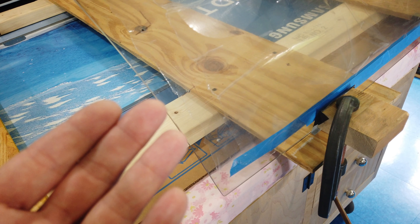I've got my lift struts now in place, and they without question push the entire canopy frame forward. Before putting the struts on I was working on the gap along here so the canopy could physically open - I wanted to make sure it could open and close freely first, because the struts push it open and if you don't have clearance you're going to jack your skins. For me personally, I've got about an eighth-inch gap here. I kept sneaking up on it and had to have it this wide just to get it to open and clear the front skin.